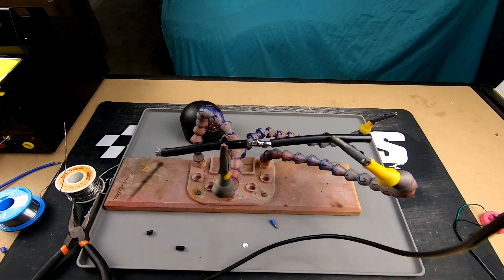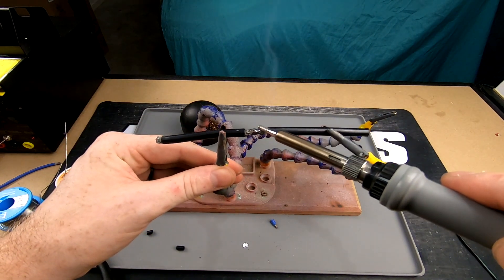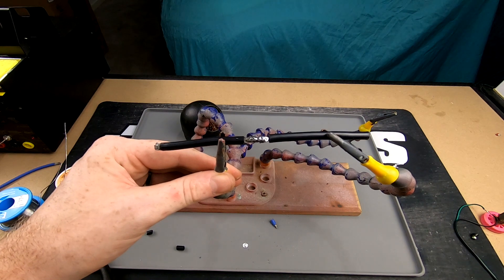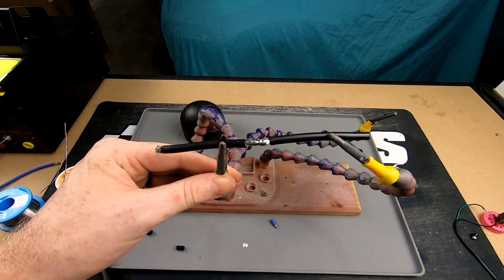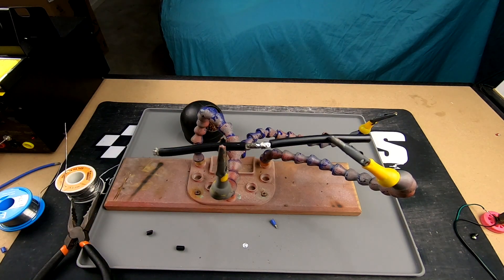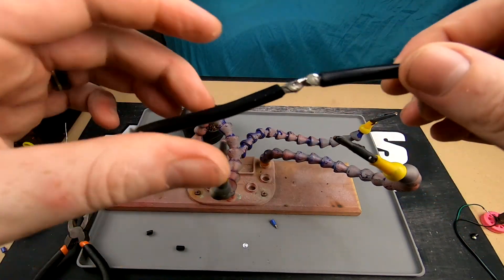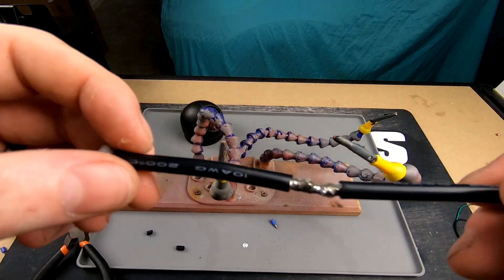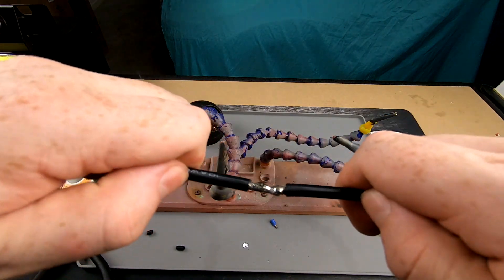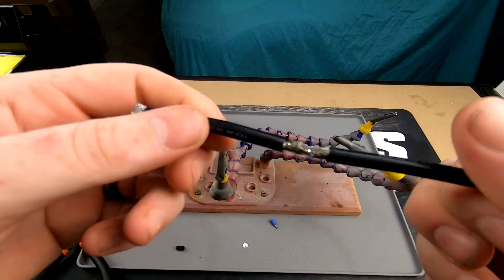Sorted up. I knocked it — the worst thing about thick wire is you get so much heat into it, you've got to let it cool for a little bit. This is where having a little external fan would be handy. There's actually a USB port on this which you could hook up a little USB fan. Letting the solder naturally cool is going to be better and stronger, but a little air helps. Once again, you can see it hasn't actually penetrated all the way through, but it's still a strong solder — cannot break that joint.